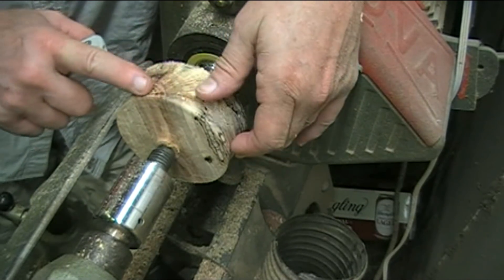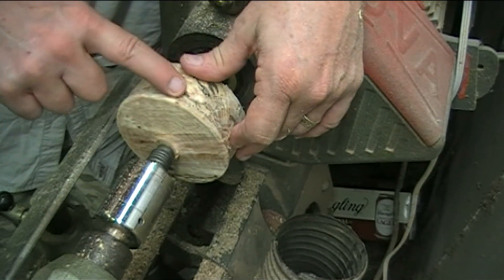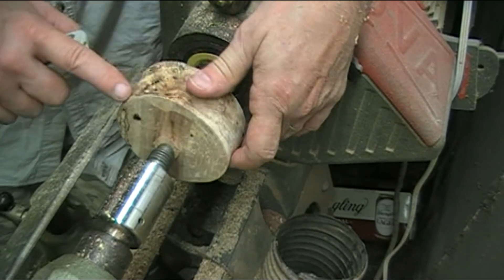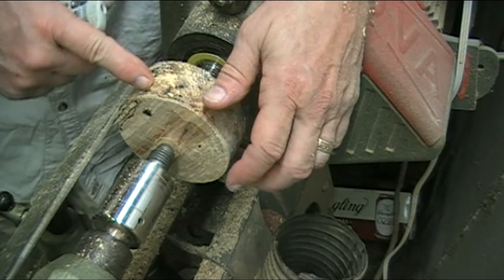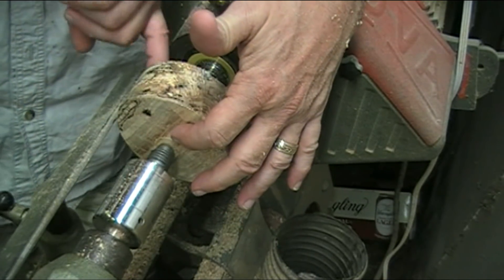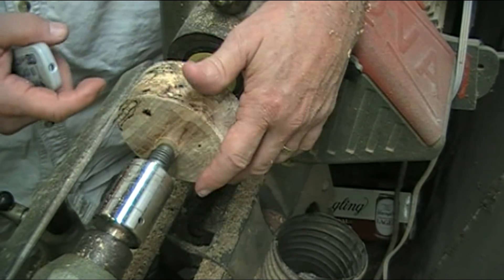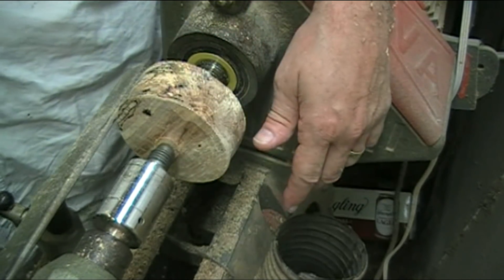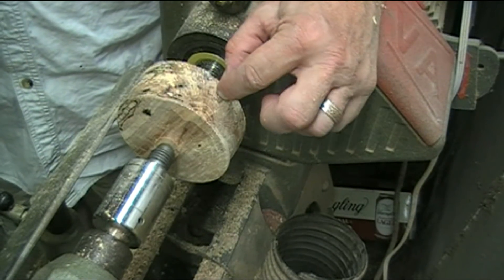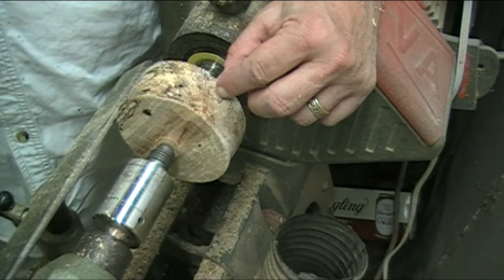Alright, so I got some holes to play with — worm holes and cracks and stuff. There's a big worm hole right here. This is going to be the bottom and this is going to be the open end. I'm gonna take it off the lathe and drill it so I can tap it and then use my mandrel. It's way too thick — it only needs to be about that thick. I've got to cut about a half inch off of it, which is not a problem. Once I get it chucked up it'll be good.